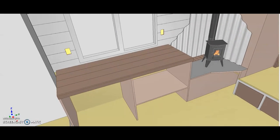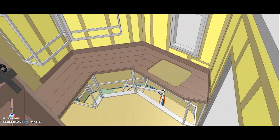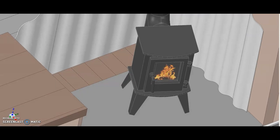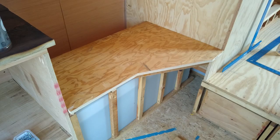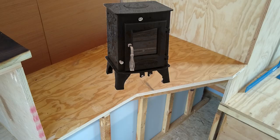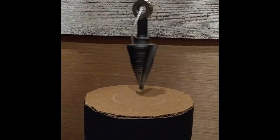We used a wood-burning technique called Shou Sugi Ban on barn wood for our countertops and our barn door. Fun fact: we designed our entire build around our tiny wood stove. We ordered the Dwarf 3K before we even ordered our trailer. After we determined where the wood stove would sit, we drilled four holes in the hearth and temporarily bolted the stove in place. We used a homemade plumb bob to mark where the flue would go through our ceiling.